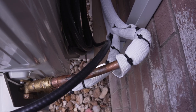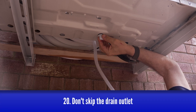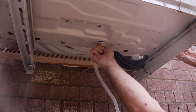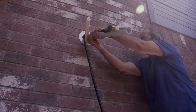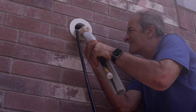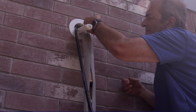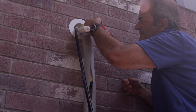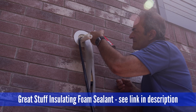Once you've mounted the unit, be sure to install the drain outlet. Most videos don't even show this, which means you might be tempted to skip it, but don't — in the winter, if you're using this for heating, it will collect water. Now place your hand on the underside of the piping close to the opening, then slowly and with even pressure, bend the piping down until it's flat against the wall. Once that's done, go ahead and finish sealing up this hole. They give you a little package of neoprene, but I like to use spray foam — I find it easier and a lot more effective.